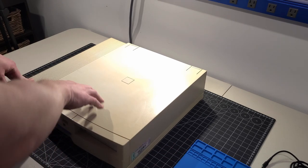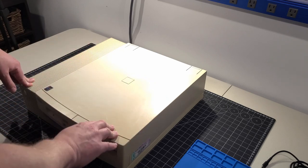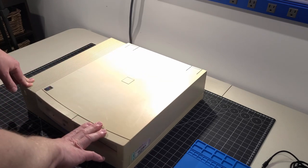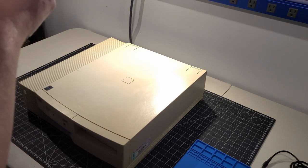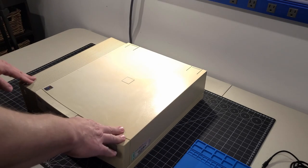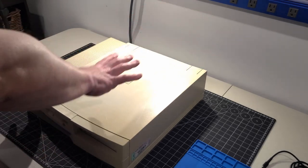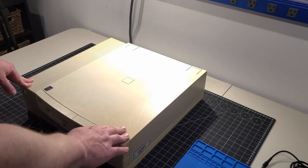I'm not very familiar with this particular machine, but I could see visual damage to the caps, so I figured we'd do a repair video showing the teardown of this PC, the removal and replacement of the bad capacitors, and then putting everything back together — just for something fun. The capacitors weren't available on Amazon or locally, which surprised me, so I went to DigiKey and got the capacitors I needed with the proper capacitance and voltage. I've never taken one of these apart before, so we're on a journey together.